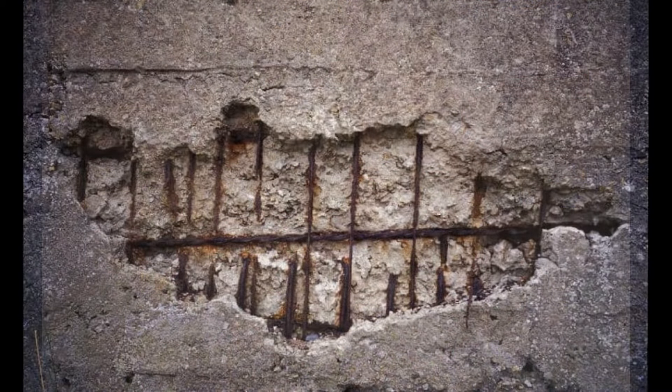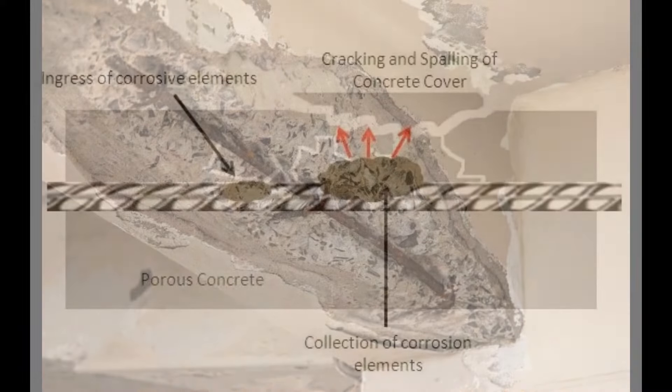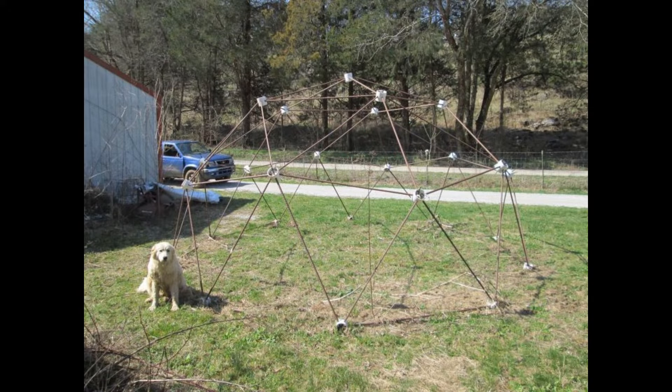Spalling is when a thin layer of concrete is put over metal rebar, and the rebar can rust and expand inside the concrete, making the concrete crack and fall apart. So to use metal rebar surrounded by 2-3 inches of concrete, I would have to build a concrete form with an inner and outer plywood shell on the inside and outside of the dome, strong enough to hold 4-6 inches of concrete around the rebar to allow it to set — which is not a practical low-cost solution.